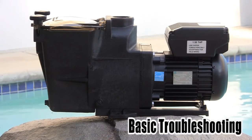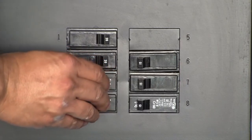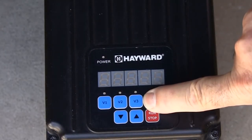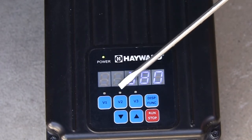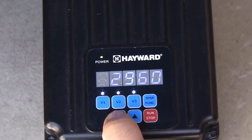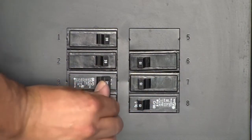We are now going to talk about basic troubleshooting. When troubleshooting the pump, it may be useful to run the pump without program functions being active. This can be done in service mode, which only allows motor RPMs to be changed. Service mode is entered by removing power to the pump and then pressing and holding the display function button as power is turned back on. Test will briefly be shown on the display and the LEDs for V1 through V3 will blink together to remind the user service mode is enabled. The pump RPMs can now be adjusted using the up and down arrow buttons. To exit service mode, cycle the power off and back on.